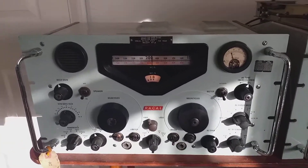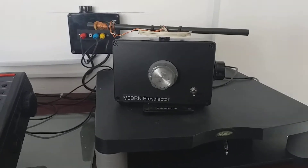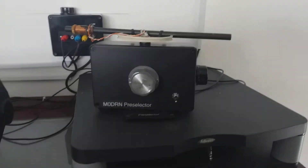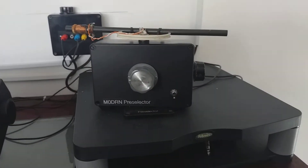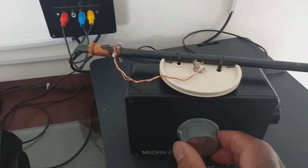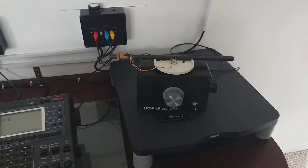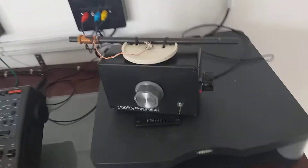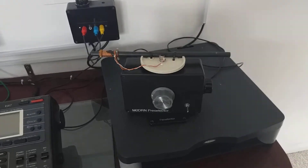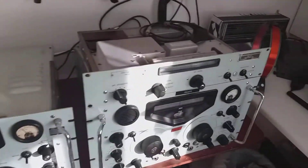How do I manage to tune it in? I've got a medium wave pre-selector here which is homebrew. It uses plug-in coils - that coil was taken off an old receiver that had longwave on it. So I'm actually using the homebrew pre-selector. You can get a commercial one too. This simple pre-selector is no more than an aerial amplifier with a ferrite rod from a medium wave set, and a tuner - that's all it is, like a loop amplifier. It's homemade; if anyone wants the circuit, contact me.